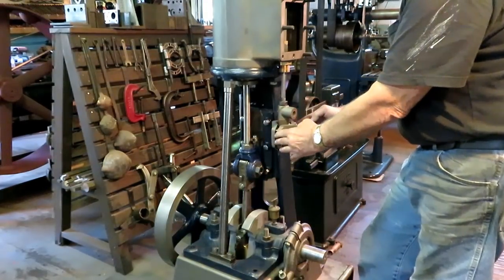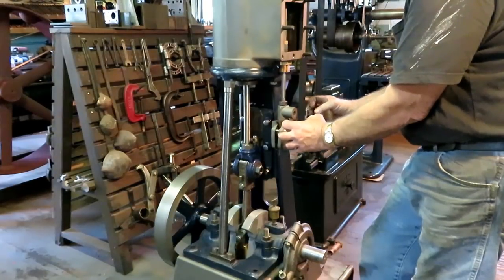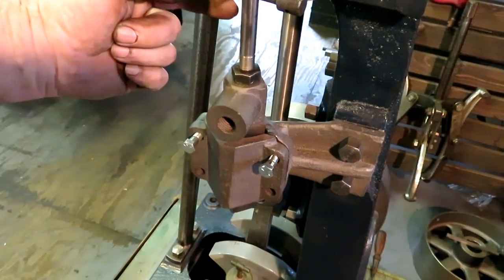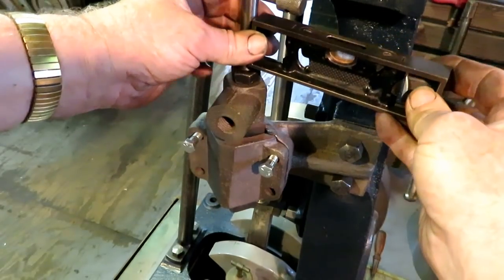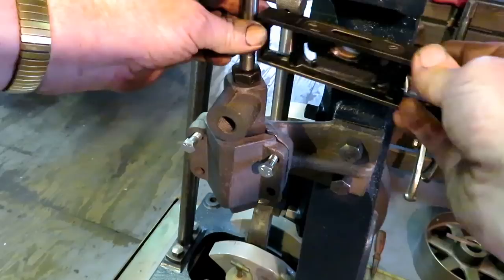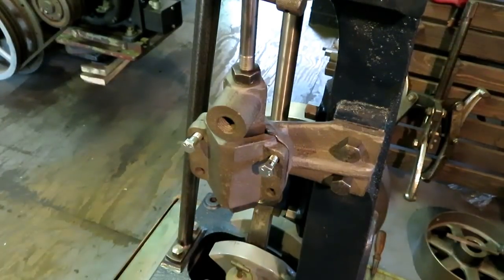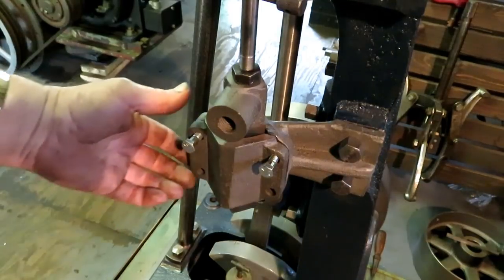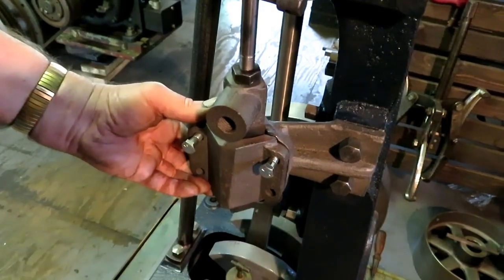And if I have my shims so that they come in right up against this corner, I should be able to get it broken apart after the pour. Okay, so with this valve shaft leveled, I don't know if you can see that bubble, but it's pretty close right there. The slide here is right up against the housing, so it leads me to believe that this was never really very accurately put together in the first place. These holes have got a little bit of leeway in them, but not enough to get over that way.